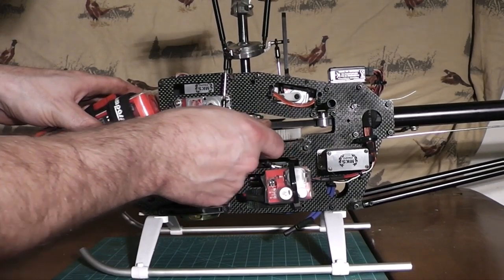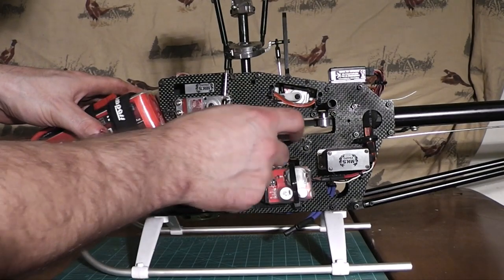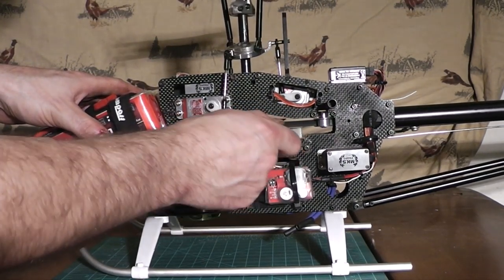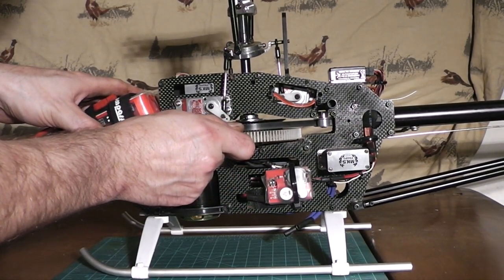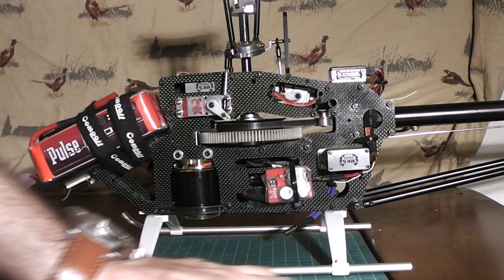It's really loose there — we're almost opposite of our high spot. Really loose. There's the high spot right here — getting a little tighter, getting a little bit tighter, getting even tighter. And the actual high spot is where there's almost no clicking. Okay, we know we're on our high spot now.